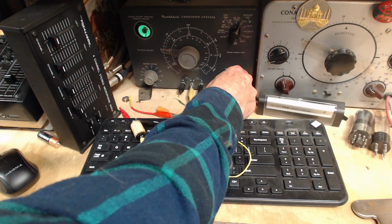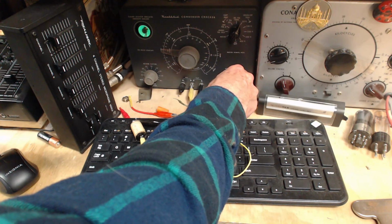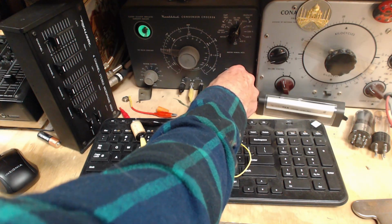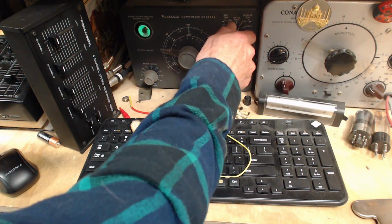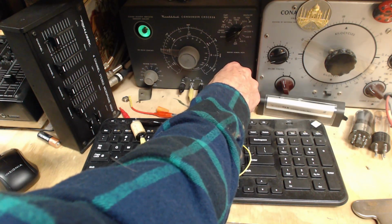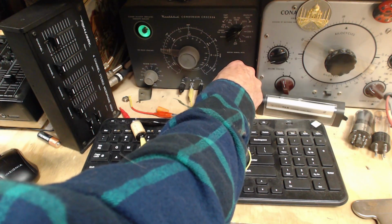Okay, it's about 25% open, 30, 40%, close to 50% open. But this is 50 volts. It should come open completely. For goodness grief, at 150 volts, it's just never going to open. So comparatively, this is a leaky capacitor.